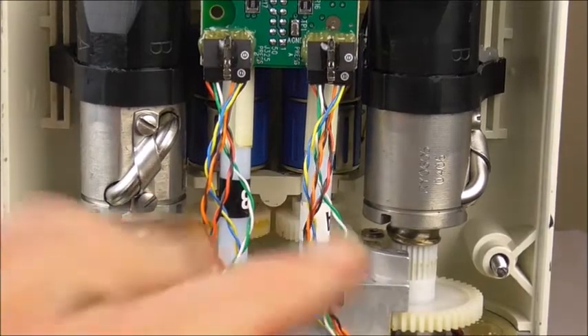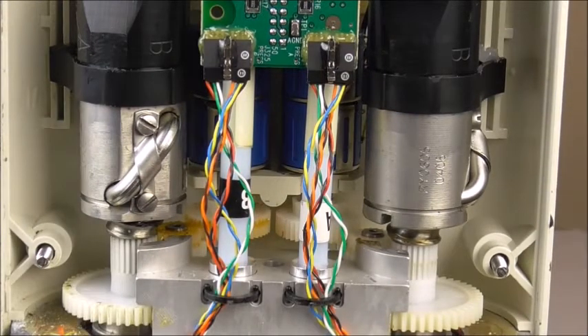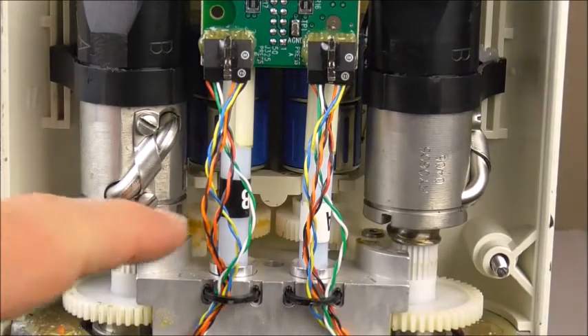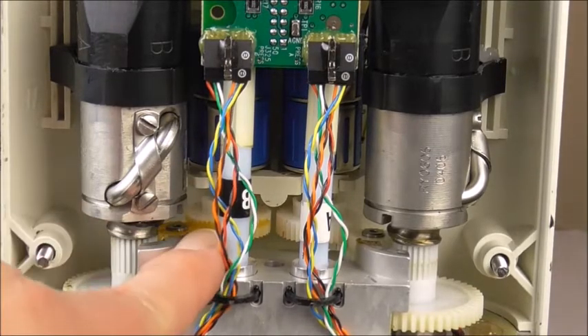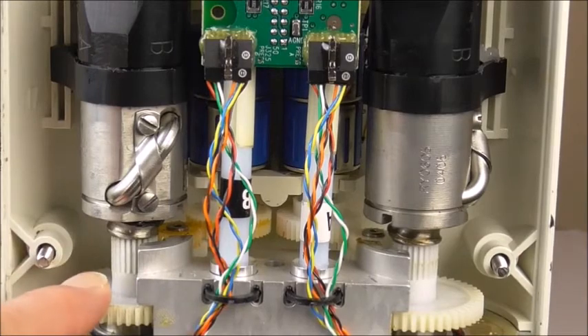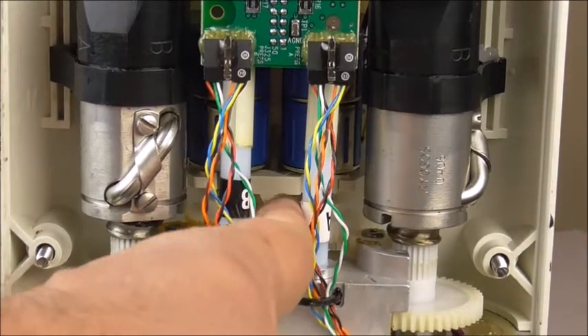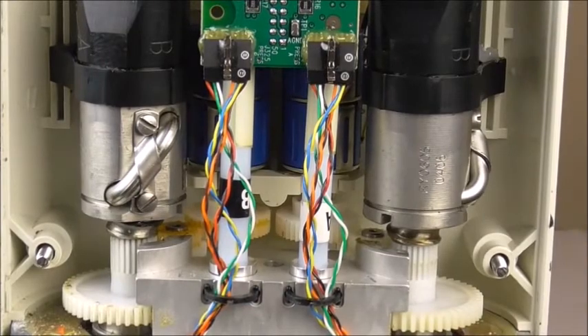That bracket does break sometimes — it's just a little plastic bracket. If that plastic bracket breaks, you're dead in the water because then the potentiometers are flopping around in there too much. They're not going to stay; the gears on the pot are not going to stay in contact with the gears on the piston when the piston is moving up and down. So that bracket, although it's a cheap little piece of plastic, is very important. If it breaks, you have to replace it and you basically can't use the injector until then.